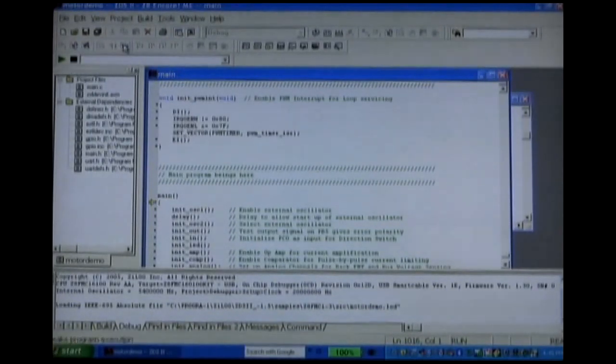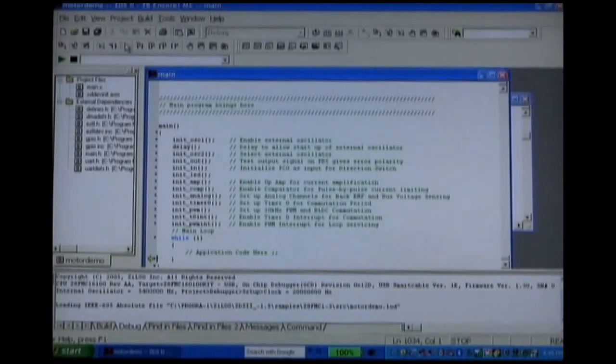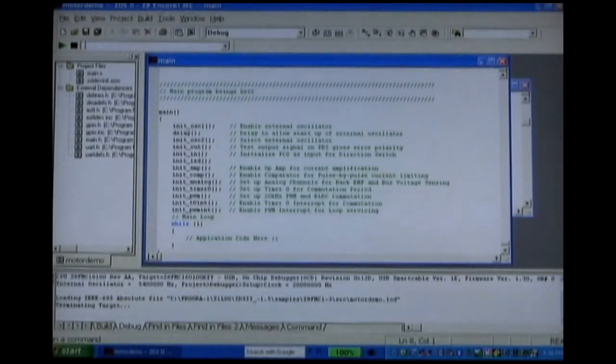So usually what I recommend is that if you're going to disconnect or anything, make sure you hit reset so it goes to the default reset condition. So hit reset. And then this icon here is for stop debugging. That means that you're disconnecting the ZDS2 from the application target. So we click here and then you see that all these icons go away and it's not connected anymore.